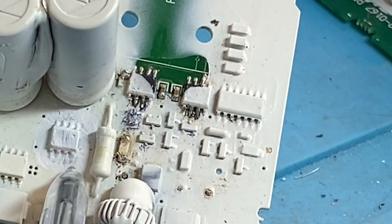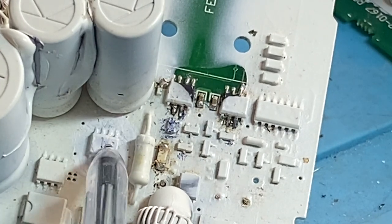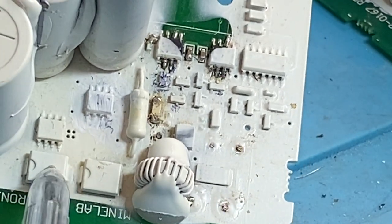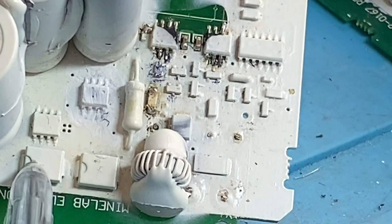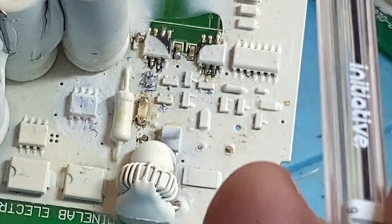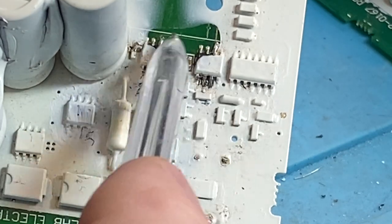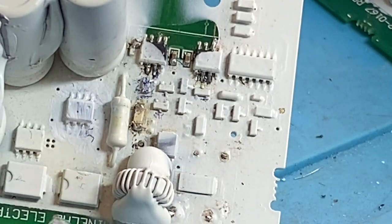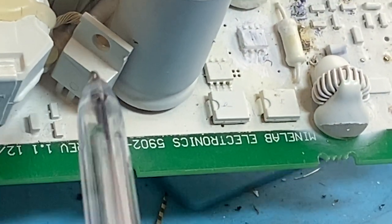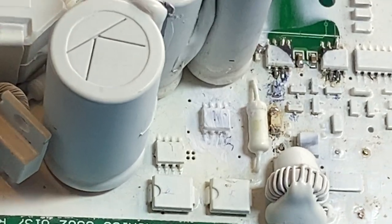The other thing can blow up too. It can also avalanche the coil driver stages, take those out. These diodes are only rated for 200 volts as well. They're rated for 200 volts. You can avalanche those as well. So just having one N-channel high voltage MOSFET fail, unless the detector shuts down, it can take out everything. It just takes out everything, like getting hit with lightning, literally. And so if anything does fail, if this fails, you want it to go short circuit, because it doesn't allow anything to get destroyed.